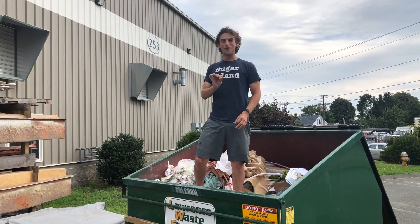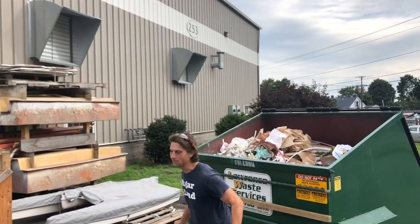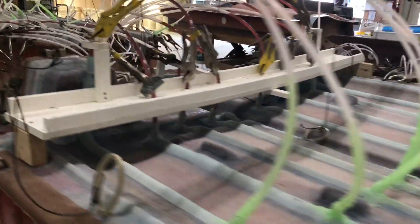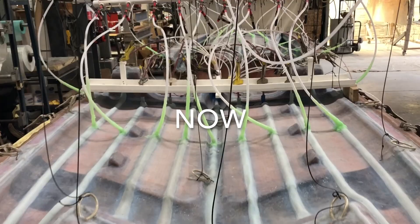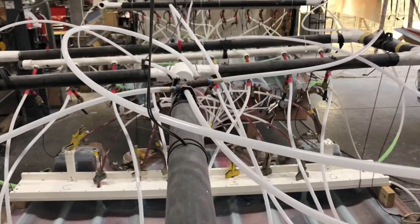Let's move on so I can show you how we solve that here at Fulcrum. What you're seeing here is Fulcrum Speedworks' Flying Spaghetti Monster — a unique silicone reusable vacuum bag system which consistently deploys the infusion and compaction layout required to build our boats without any waste materials. This decreases the amount of waste we create across our shop by a factor of between 50 and 90 percent depending on how the numbers are stated.